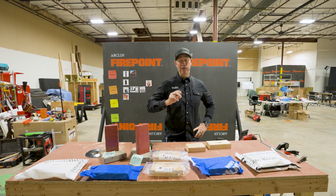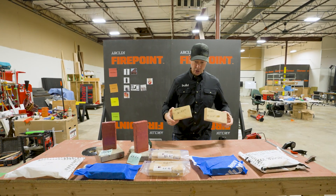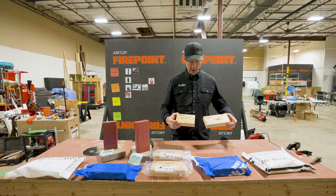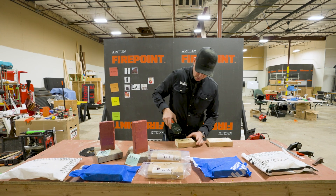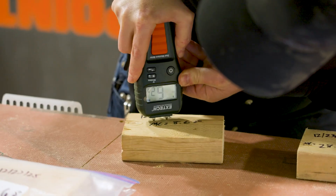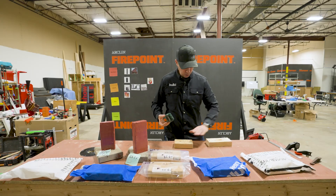We're back from Christmas break — it's been just shy of two weeks, actually 13 days. Let's check the moisture content of all these. These were outside, not quite in the sun, and we had kind of mild conditions here in Austin, Texas. This was our control at 8.6% moisture content, and it's actually dried a little bit — it's at 6.2%, so still pretty dry.